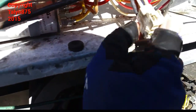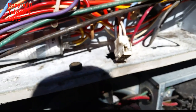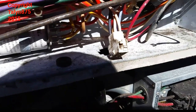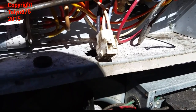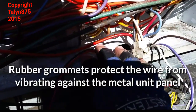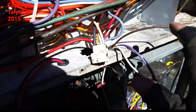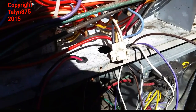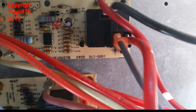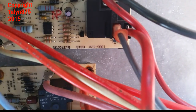With the plug taken apart, you can see the broken-off pieces inside the other side of the plug. I'm going to split two little holes and use rubber grommets to bring everything through — one for low voltage wiring and one for high voltage wiring — to make it neater and get this thing running again. I also attached the wire to the blower relay on the circuit board so that if the sequencer gets locked in place or if it turns on emergency heat, it will send power to the fan.